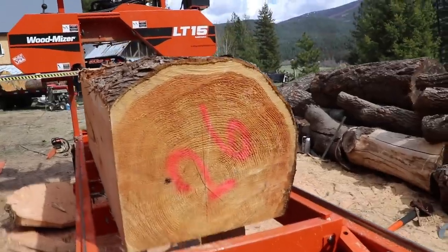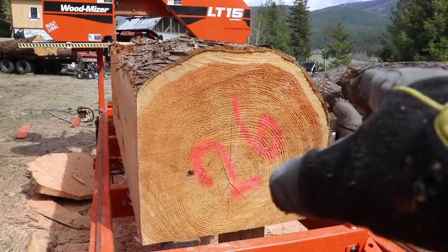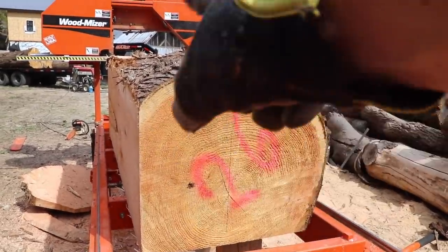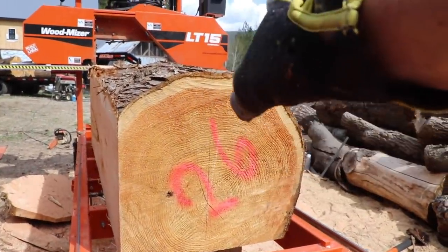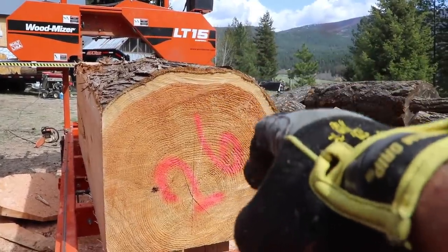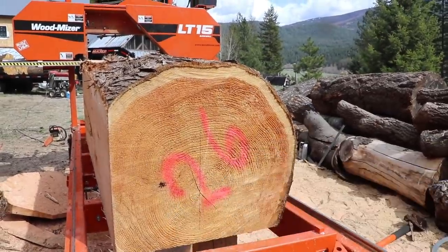The other option we have is if we end up three siding this log, we could rotate it on its back and take a cut off of it and then use this good four or three-sided portion for posts, and then we'd have maybe half of the log there that we could use for live edge boards. That way we're not getting these humongous 24-inch wide boards.